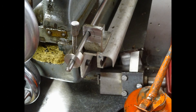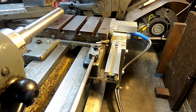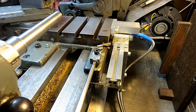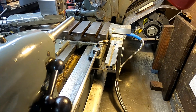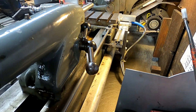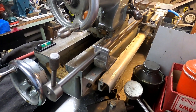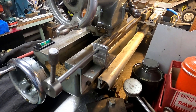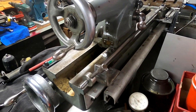If you use this method of stopping when using the carriage power feed — when the lead screw is under power feed — it's generally a good idea to stop the cut before the stop gets fully home and just finish the end of the cut gently using the hand wheel of the carriage, rather than have the stop slam into the end bracket. I've used this method of carriage stop on the Myford lathes for nearly 40 years and have found it to be most useful. I hope this helps.